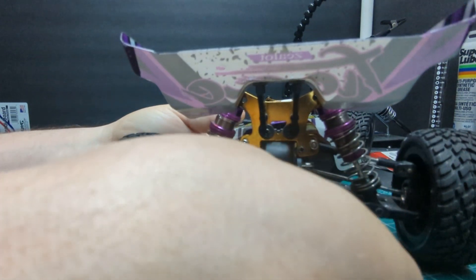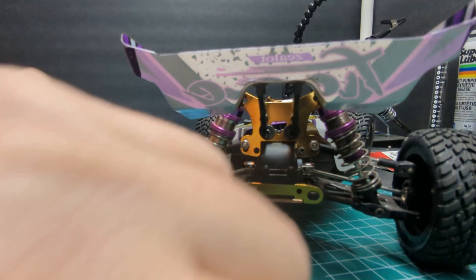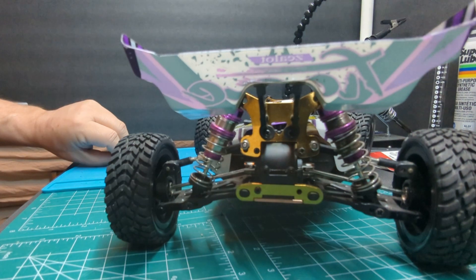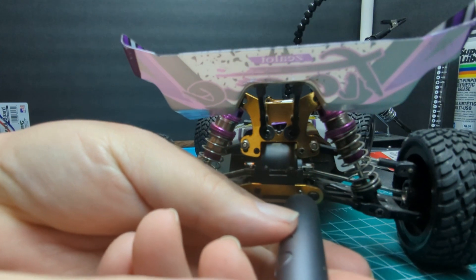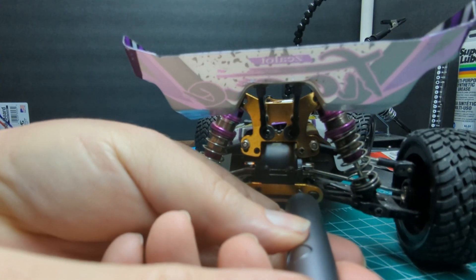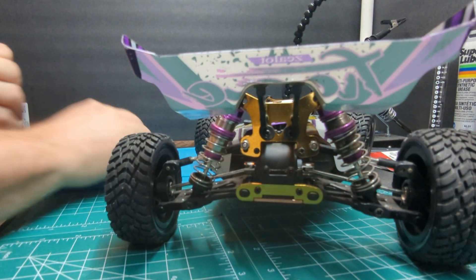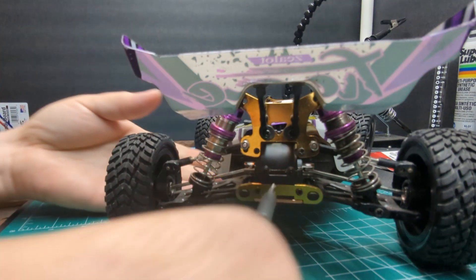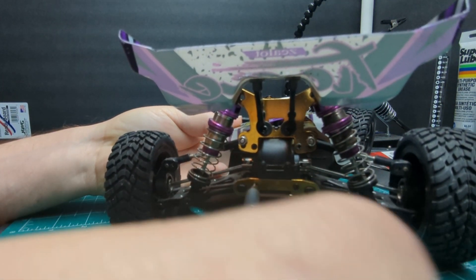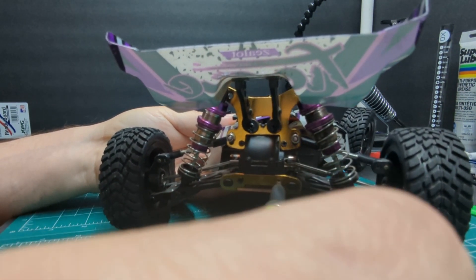The pins are engaged, you have it set back on the plate, screw it back in — not overtightening them at first. I love the electric screwdriver but I prefer to put screws in the final tightness by hand just to make sure you're not overdoing it. You are going into plastic here so you don't want to overtighten.